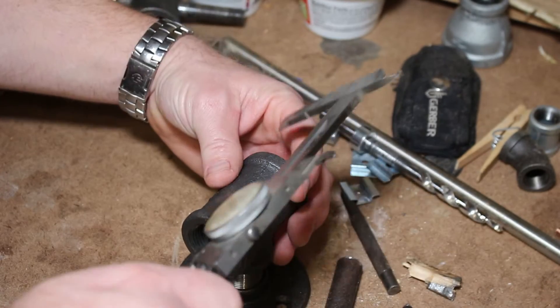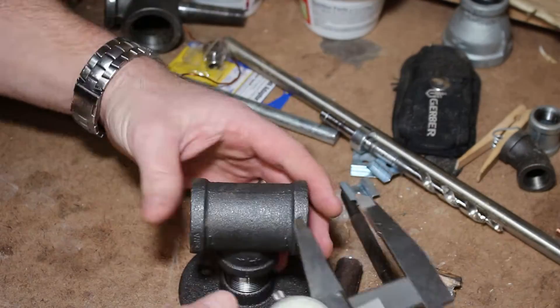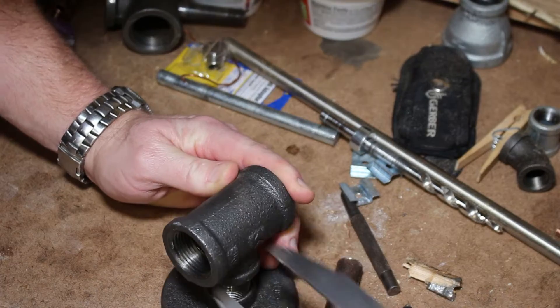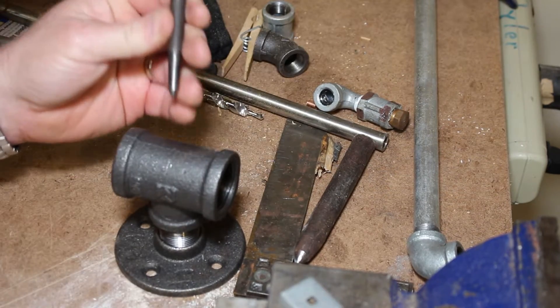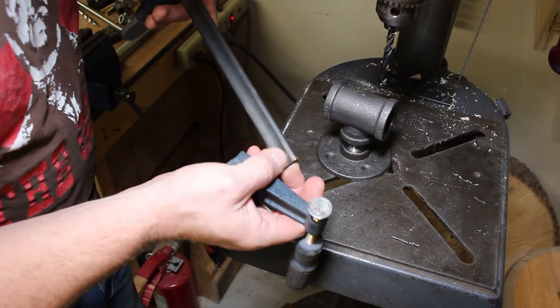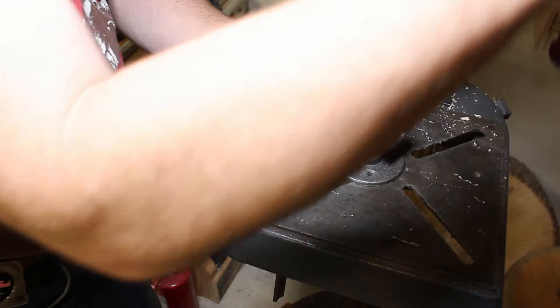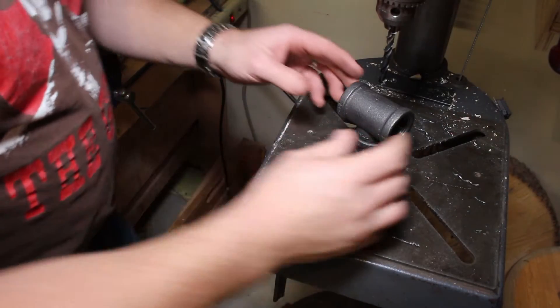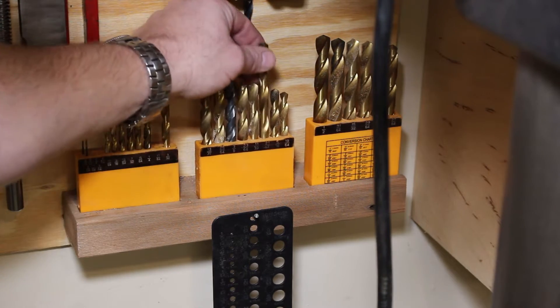I'm going to use calipers to find the center — take the overall dimension and cut it in half. I center-punched exactly in the center, so that's where we're going to drill and tap. To clamp this down, I'm using a cheap six-inch Harbor Freight wood clamp. I shaved off the little nub at the end with a grinding wheel so I can feed it through the table and have it clamped down. The 1/8 by 27 tap takes a 21/64th drill bit. It doesn't hurt to do a pilot hole first, so that's what I'm going to do.